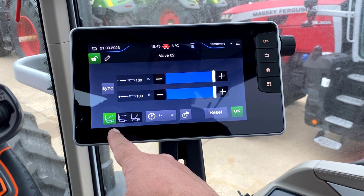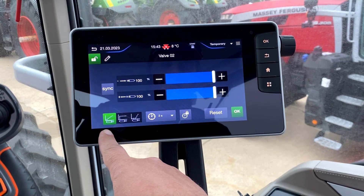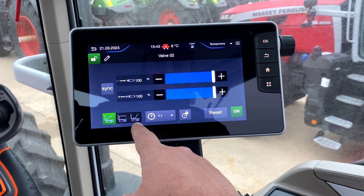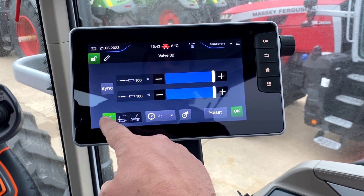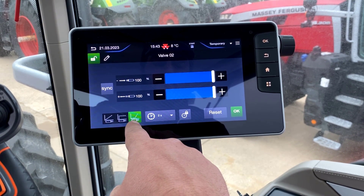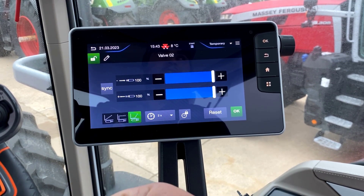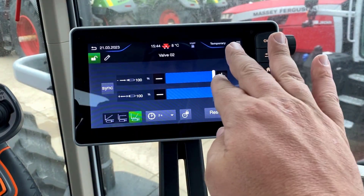In the bottom left-hand corner you will see engagements that we can select. You'll see a steady ramp that is all on, and there is also a slow engagement. If we select the slow engagement, we would use this more for our vacuum fans on our planters and some of those motors — that way we get a more gradual engagement.